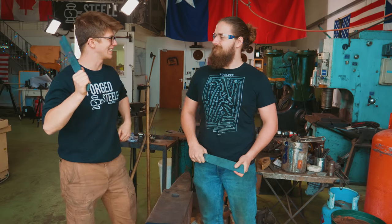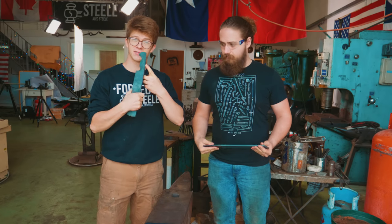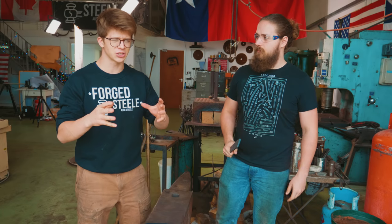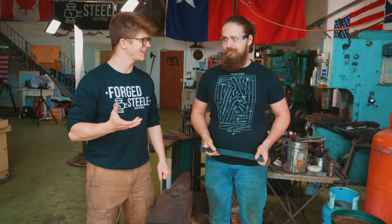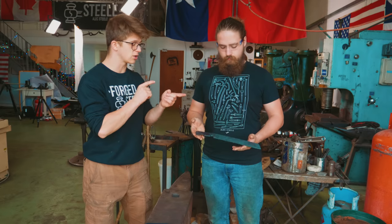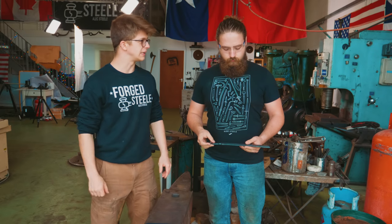Let me tell you a little bit about what I have learnt with this little endeavour of forging — well, trying to forge one knife. It's been a long time since I've done any forging and I have got really, really bad at it. Despite the fact that our first knife had a very short tang that wouldn't have been enough for the handle, we ended up getting pretty close on the second one. It took a lot of time. Skills are perishable — certainly things to maintain. After the forging process we did the heat treating: we did normalizing cycles — about three of them — and we did a spheroidizing cycle. That makes it extremely soft because this is O1 steel, so it's very hard. It's going to be a little bit of a nightmare to work, and that can help it get a little bit softer. This isn't the full and final heat treat, but this prepares it so that we can work it well.